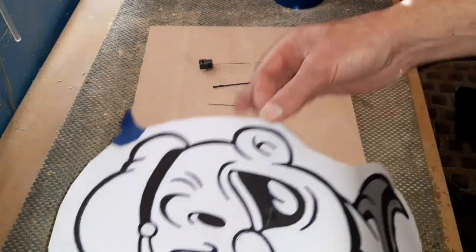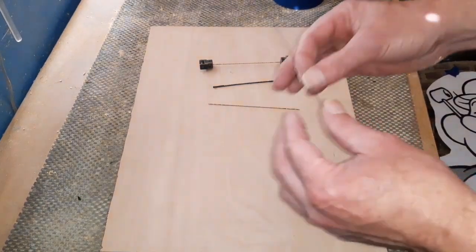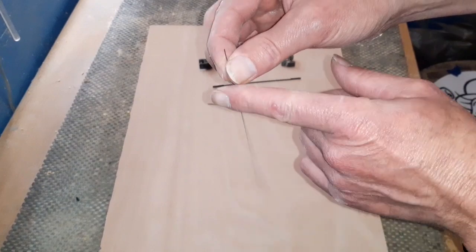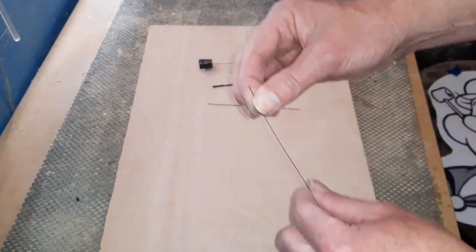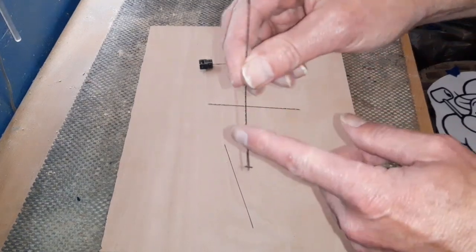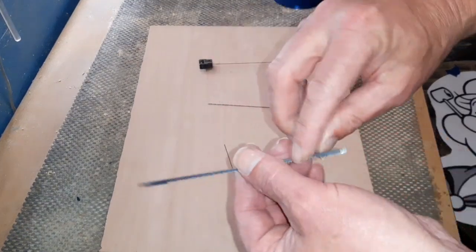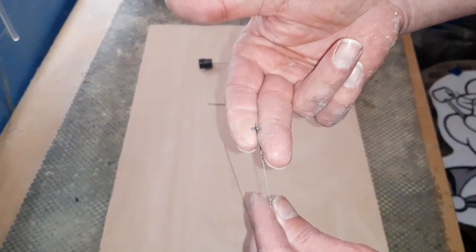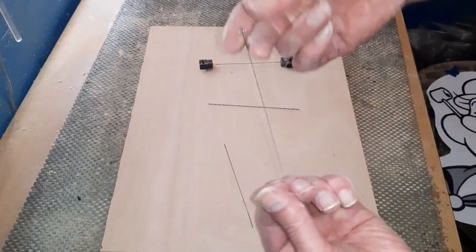They come on your fancier saws, should I say. And they literally just have a clamp, top and bottom. You have the teeth facing towards you, and they want to feel smooth on the way down and rough on the way up. Same with your pin blades. Smooth on the way down and rough on the way up. And they just literally hook into a clamp at top and bottom.